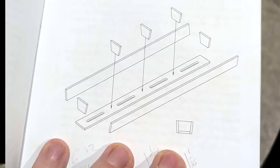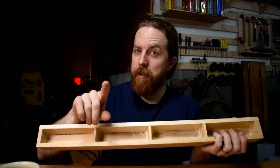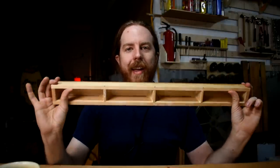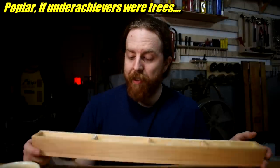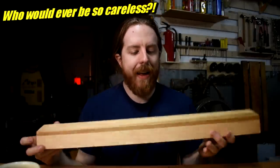Now we're starting the lathe bed and I got nothing. We need to cast a piece for this, so to cast something you need a pattern. Here's mine. It's built somewhat like the one in the book — a little over two feet long, got plenty of draft. It's got these three braces that are in the Gingery pattern, but mine differs in that it's two inches tall instead of an inch and a half, and I used three-eighth-inch thick wood instead of quarter inch. This is built out of Home Depot cheapo wood, probably poplar. I built this years ago. If I had to do it again it would probably be something harder — like cherry — so if some idiot hits it with the sand rammer later, it doesn't cause dents in there.